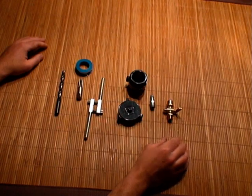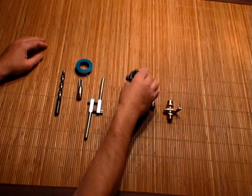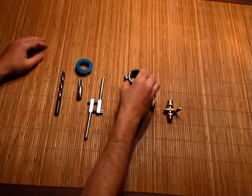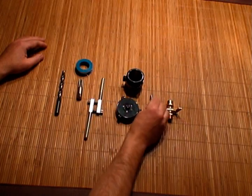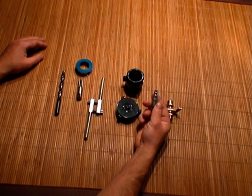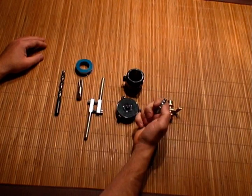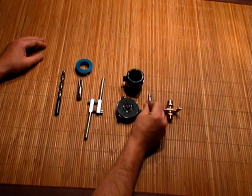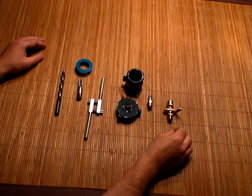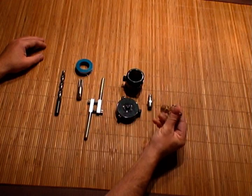Here's what you're going to need to make your own setup. First, at least one inch-and-a-half coupling cap and one inch-and-a-half double male — both of these can be used on either inch-and-a-half or inch-and-three-quarter hose line. You're also going to need an air chuck fitting; this is a quarter inch. The connection fitting is really critical — you want to make sure it's compatible with your air shoreline that connects to your fire apparatus off your compressor unit. Finally, you're going to need a quarter-inch male-to-female air shut-off valve.